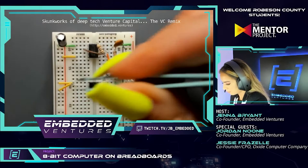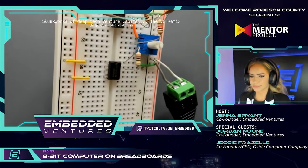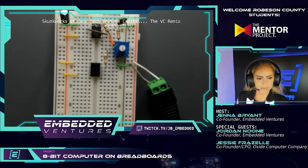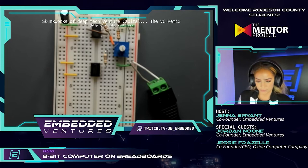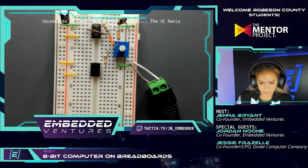Connecting pin 4 to power — that looks great. Step 2.1.7: go to your bin of capacitors and find a 0.01 microfarad capacitor. Check in the pamphlet — it's the one labeled 103.